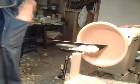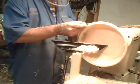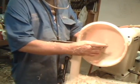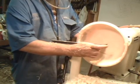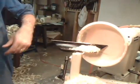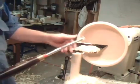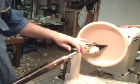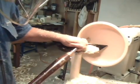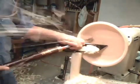I want to check my depth again. One and 1/8, 3 1/4. So I need about a 1/2. No, but another 1/4. I'm going to come back with my finish gouge, and I'm going to pick up this cut with my finish gouge right here in the transition, or just at the beginning of it. I'm going to pick up that cut, find where it starts cutting. Once it starts picking up, then I'm going to make that transition.